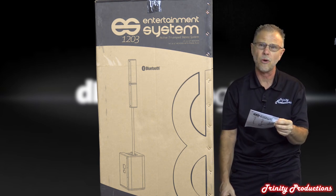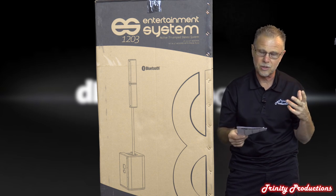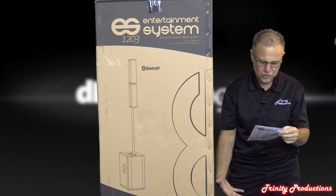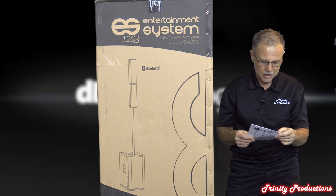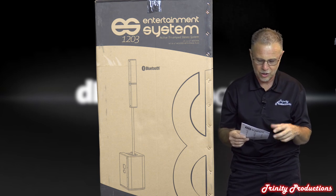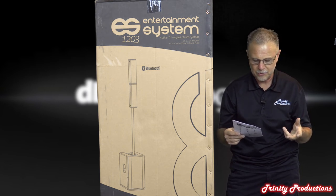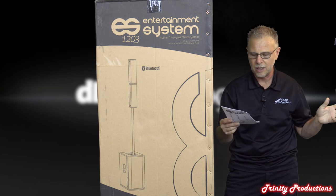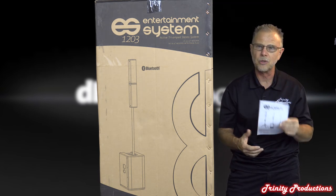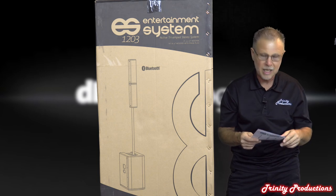The two satellite boxes each have four 4-inch drivers with 25mm neodymium voice coils, and can be used as separate left/right top boxes or coupled together. The low frequency driver is two 12-inch subwoofers. Crossover frequency is 160 Hz at 24 dB per octave. Horizontal dispersion is 97 degrees, vertical is 60. The coupled tops have electronic steering - you can angle up, angle down, or straight out.